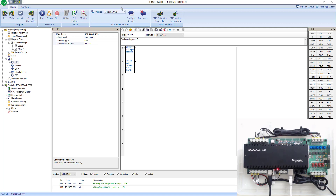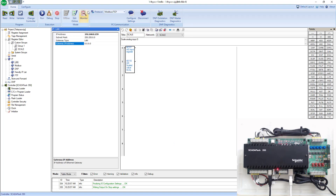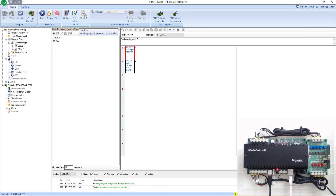Now instead of using USB as the connection, I'm going to go ahead and pick Modbus TCP. Once I select Modbus TCP, I have to go into the configure settings and put in the IP address of my SCADA pack, which is 192.168.0.159, then hit OK. Once I've done that, I hit Monitor and now I'm online with my SCADA pack, but over Ethernet this time.